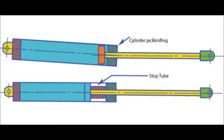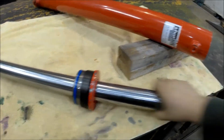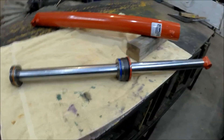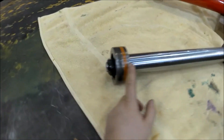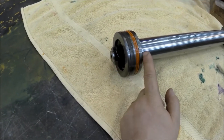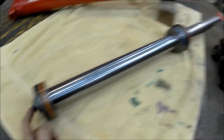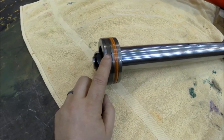What I'm going to do is create a stop tube — I guess that's what they're called. There are two ways of restricting a cylinder: one is to put clamps on the outside so it can't retract all the way, but for me the issue is not retraction but extension. The only other way would be to cut this off and shorten the actual rod then re-thread it, but it's just way too long for my little lathe.